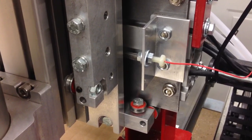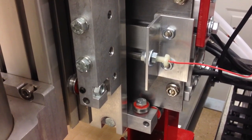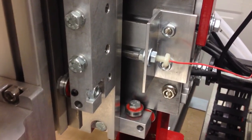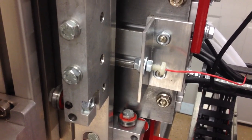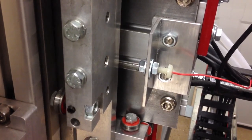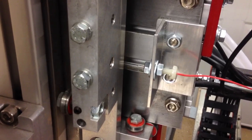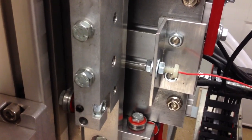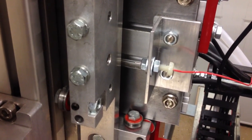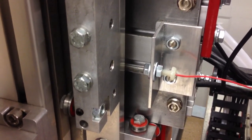It is very accurate and repeatable. I still have to do a repeatability test, but just by looking at the very slight sliver that appears when it moves off the gantry, that's less than a thousandth of an inch with my feeler gauges. So I think this thing is going to work well. I'll just do a homing test.